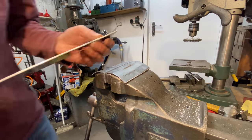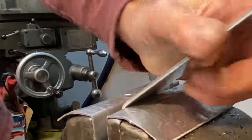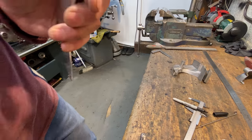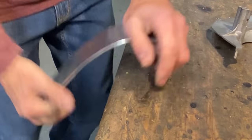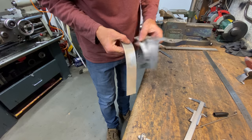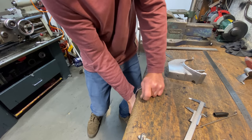That fits nicely, so now I do the next bend — perfect. And now for the hard bit: bending the big curve. I use the edge of my bench and gradually pummel the metal across until it bends into a nice radius. That's the first curve lining up nicely; now to adjust the tighter curve at the bottom, and eventually it'll fit just right.